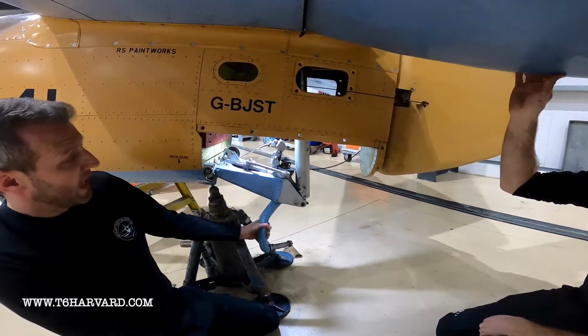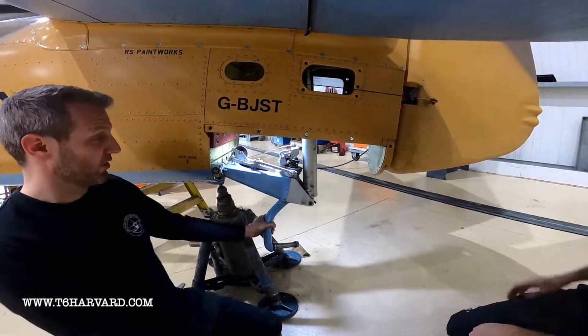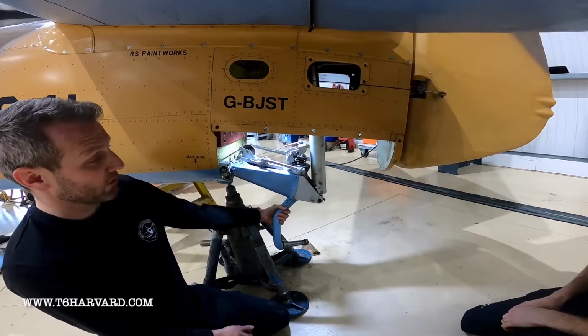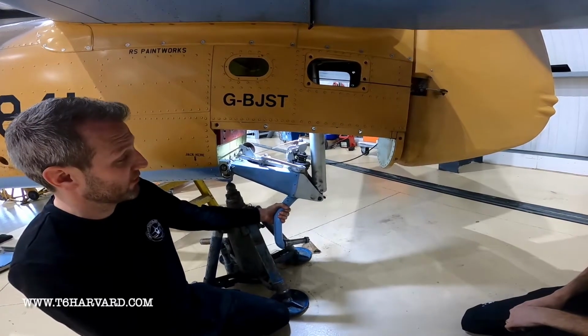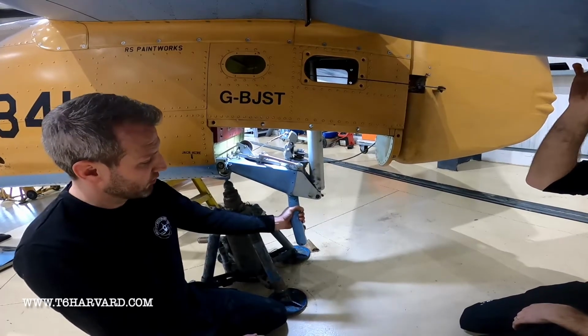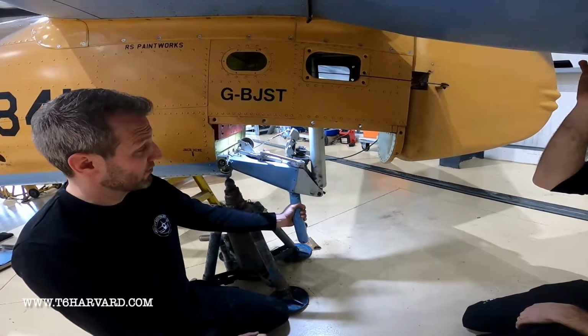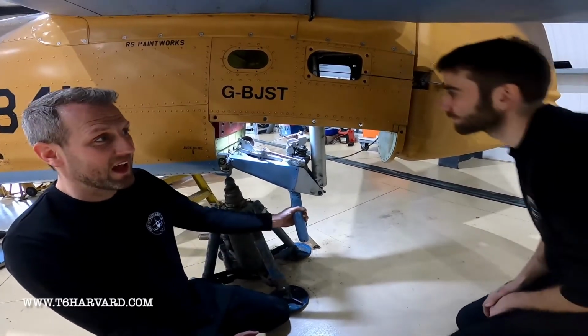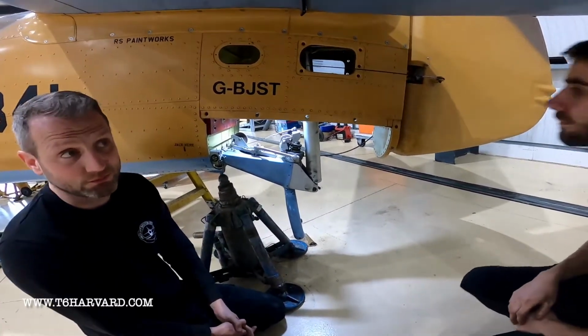So if you have your pin out, disengaged, and you're about to taxi forwards, you'll want to get the plane into the forward position. So start taxiing so you're straight, with the pin held out, so it's nice and straight. Then you release the elevator stick backwards slightly and the pin will drop in nicely, smoothly, and not cause any side load damage.